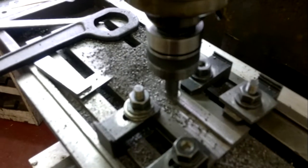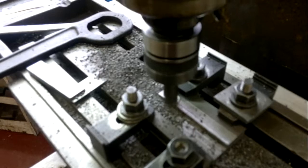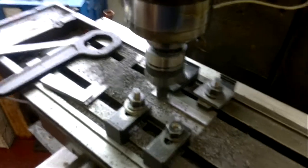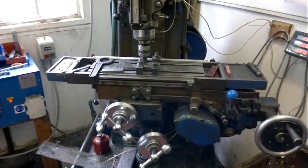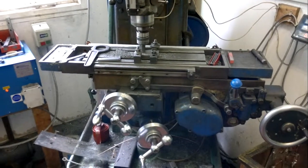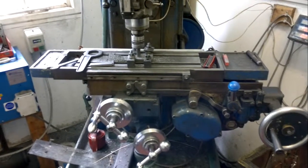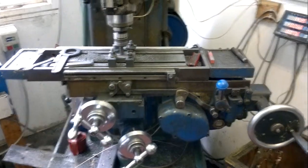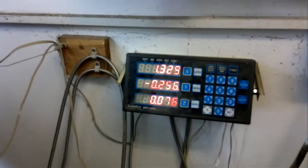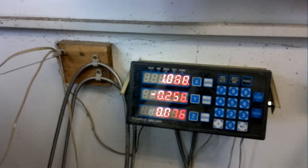We're cutting to just 76 thou this time — just keep an eye on it to make sure it's cutting towards the edge. It's running in quite nicely. We can leave that to its own devices while it cuts. We'll bring it back, put another cut of 70 odd on it to reach 140 thou, and then the final slot to bring it to the 3/16th depth, which comes out at 187. You can see the depth gauge is watching us cut down, with a little bit of flicker because we're just on the edge of that 256 and a half thou dimension — pretty much running to plan.